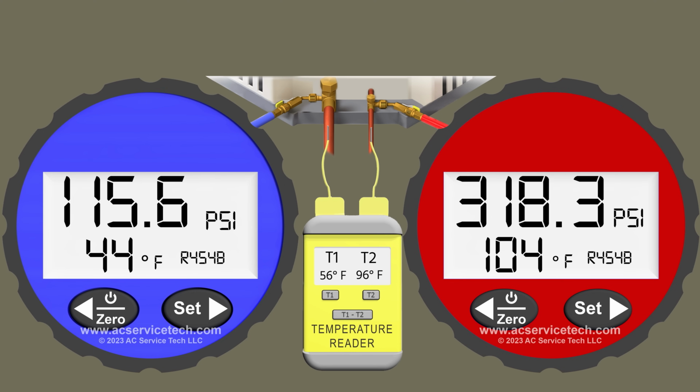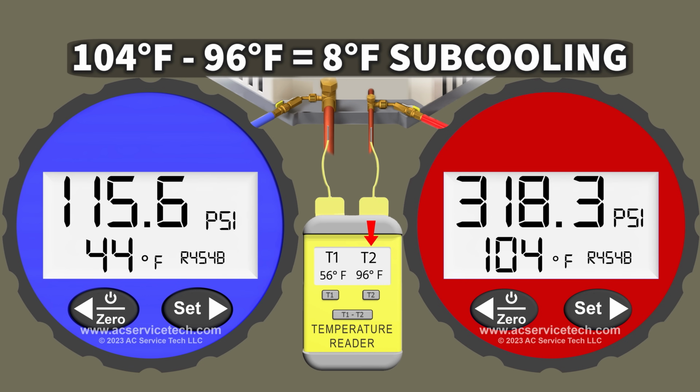And so we need that, and we also need to know the line temperature on the liquid line. And so in this case, we have a liquid line temperature of 96 degrees. So we take the saturated temperature in the middle of the outdoor coil, which is 104, minus the liquid line temperature, and we're left with 8 degrees of actual subcooling.